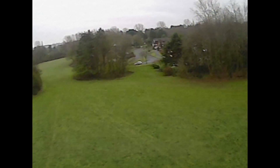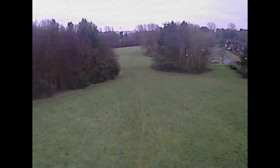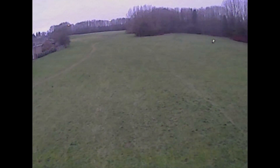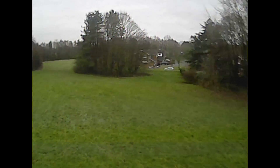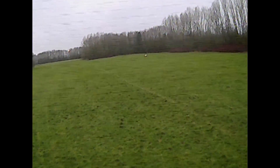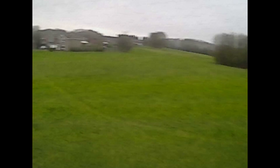It does look like I'm going to have to switch out the VTX. I am probably going to switch it out with the Foxeer Switcher, which is the best VTX that I have come across so far. I also noticed that I didn't have a very good tune on the quadcopter — I think that's because I added the HD camera. I was doing various different tricks and rolls and I could see that I was getting a wobble on the roll axis. So I landed again and went into Betaflight, and the only thing that I did was I bumped up the D value to 50 for both the pitch and the roll axis, and that seemed to give me the perfect tune. So then I went and did a proper flight with everything that I was happy with.